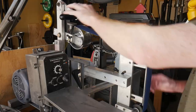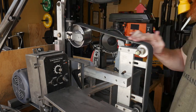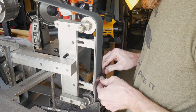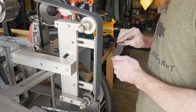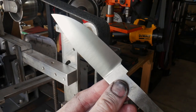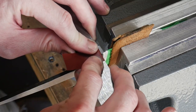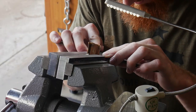After a 220 grit finish I move on to a surface conditioning belt made by Scotch-Brite — I think this is the medium belt — and it makes the grind lines a little more smooth; I've heard them described as milky. This Scotch-Brite finish is as far as I will take the blade before stone washing it. I also make sure to have all the flats in both the choil area and the spine hand sanded up to a 320 grit finish before stone washing.